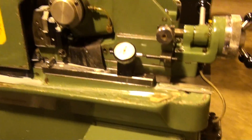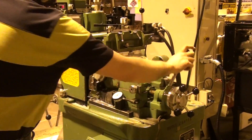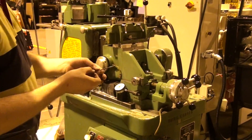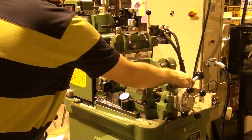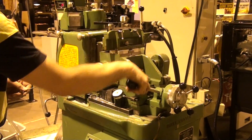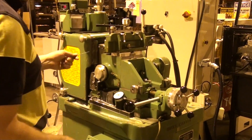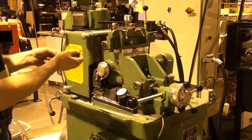Nate: We've got the wheels open — I know that because my lever's off to the left. I've touched off on my part where the wheel's turned off. So what you want to make sure is the wheels are off, levers are closed, and you bring the wheel in so you can touch off on the part — with the wheel off — to ensure that you can get to your final diameter.